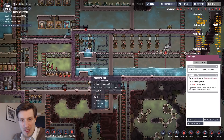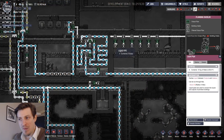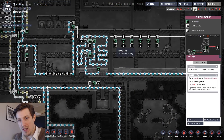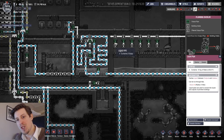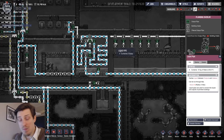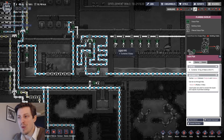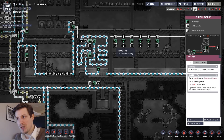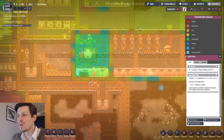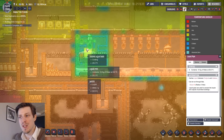This can be improved a lot in terms of efficiency — it's more like a proof of concept. What I discovered is that the dripping down effect only works when it's dripped down over hot machinery. The way it works — and maybe this was common knowledge, I don't know — is that when it drips over hot machinery, it cools the machinery more than the water is heated up.